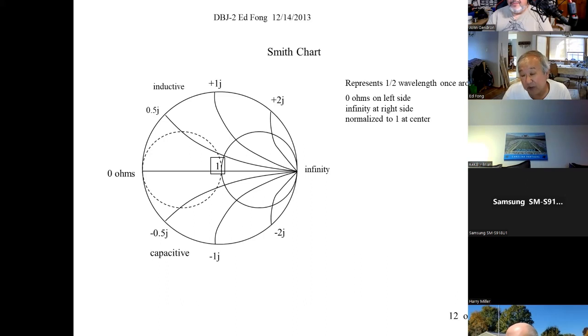And then you do the opposite. How about I give you a wooden block? Is that an insulator or a conductor? Most people say it's an insulator. It is at DC. But at AC, it doesn't take much to convince you it's a conductor, because radio waves go through buildings, through glass. That piece of wood is not going to block a radio wave. Electromagnetic waves conduct right through it. So you just have to remember it's almost the direct opposite. That's hard to believe, but that's true.